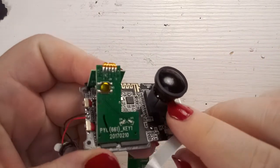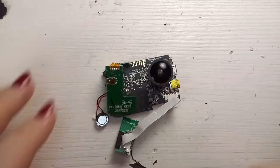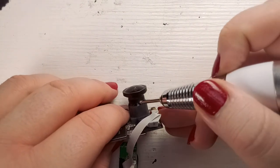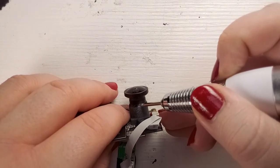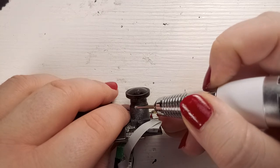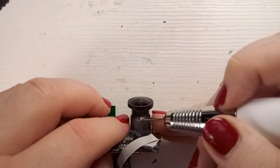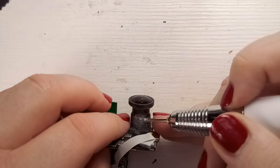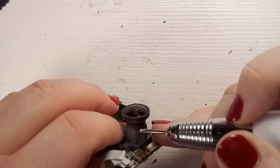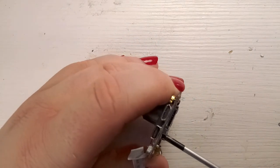Now take a close look at the lens. As you can see it is glued in place with epoxy all the way around. To remove the epoxy and therefore the lens, I decided on using my engraving machine with a diamond ball-shaped grinding bit. Any rotary tool that can use one of these or similar will do just fine. Just be really careful — the lens is made from aluminium but the holder is only made from plastic that is rather brittle. If the holder gets damaged or destroyed it might not be replaceable. Carefully work your way around and don't rush it.